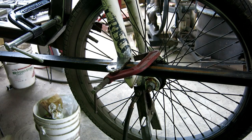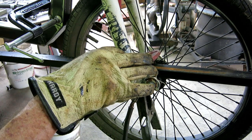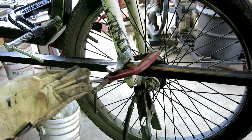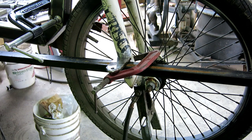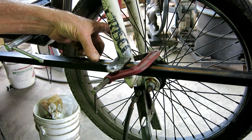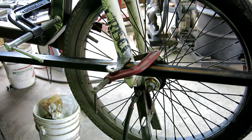I've got the front pivot in place. Kind of guessing at this. I have it low enough where the tie rod will be beneath the storage area. And I have it from the quarter inch hole to the center of the wheel is about 5 inches, and that's the same as between the center of the steering shaft and the hole in the back. So I'm going to give it a little weld. I'm not going to go crazy because this is a guess, but I think I'm close.